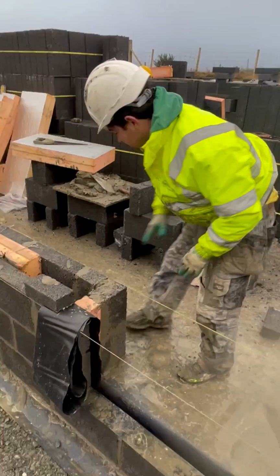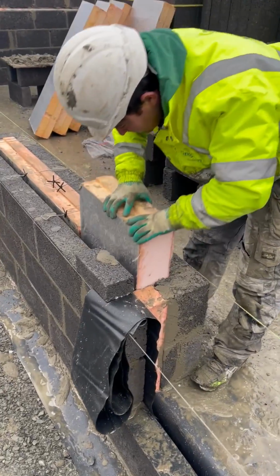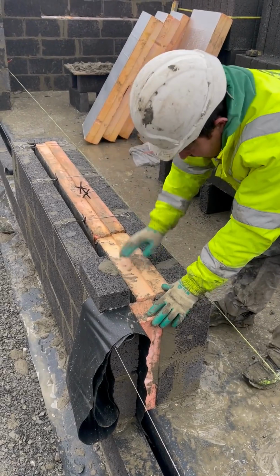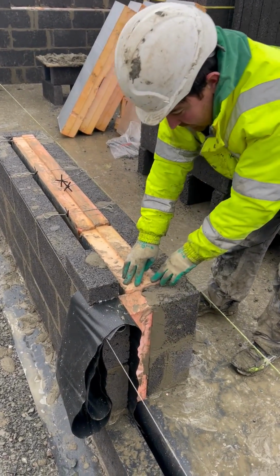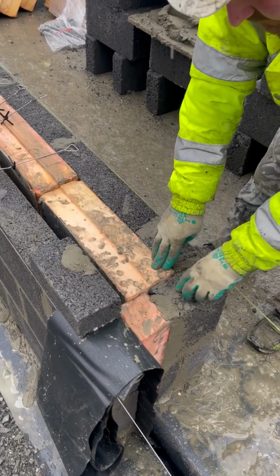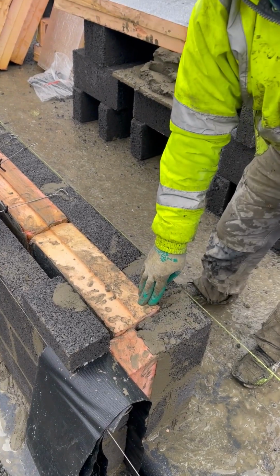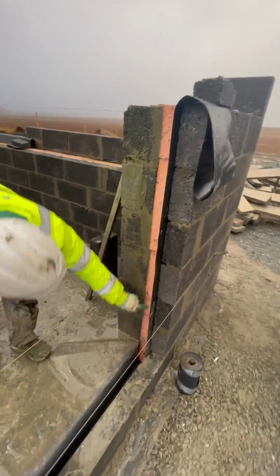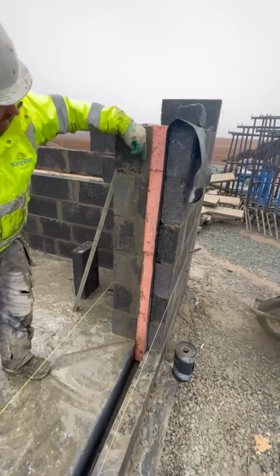And we're also going to pop in the piece of insulation. You're going to see now how the two of them are going to meet together. Piece of insulation down here, nice and tight, and again, this is on top of our green guide here. You can see the junction between our 80mm and our 130mm K8 Plus, how they're nice and tight together. Insulation is meeting, they're crossing over by 45mm, which is just perfect. You can see here on this side, as that's the way we have it, as it's all brought up, a good detail, and our window frame is going to come back here to cover all that up.